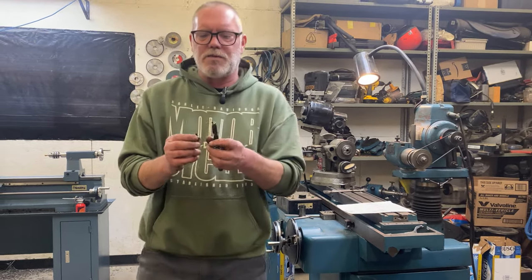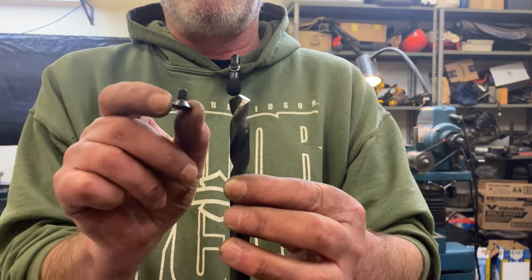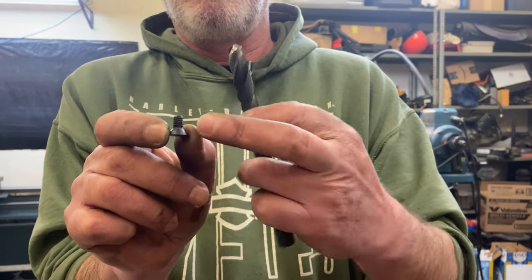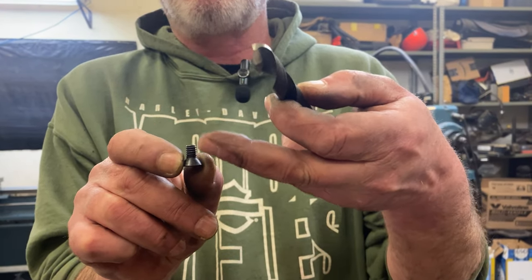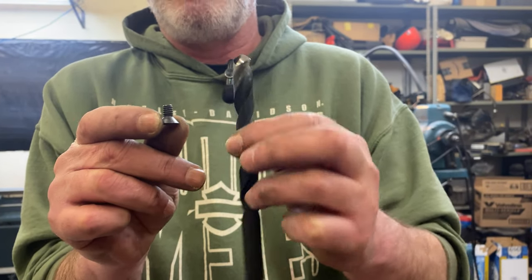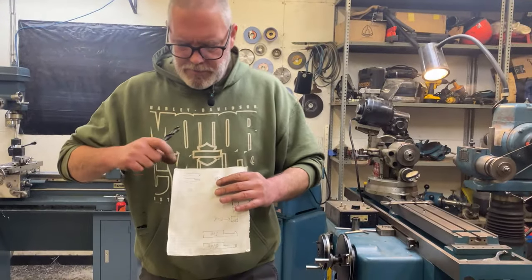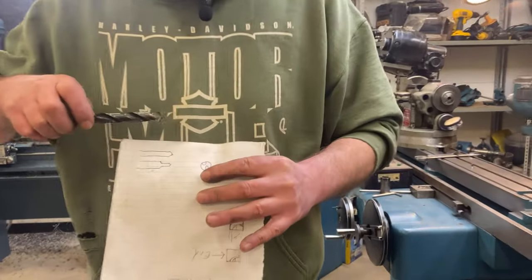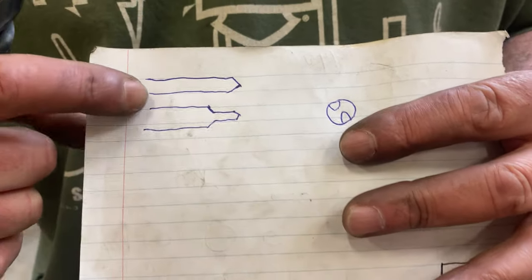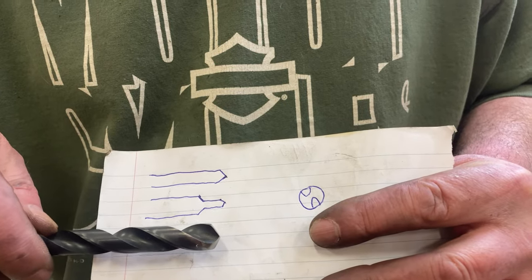What we're going to do today is take this ordinary drill bit and customize it into a stepped drill bit that drills the clearance hole for this thread and then machines this 82 degree angle for this countersunk fastener. So basically, if you imagine this being this drill bit, we're going to turn it into something that looks like that. And I'll explain all the particulars as we go.